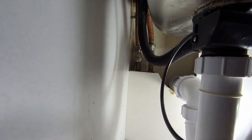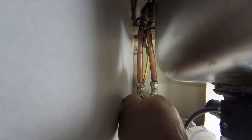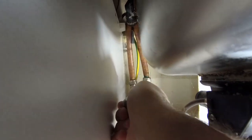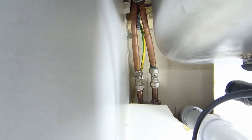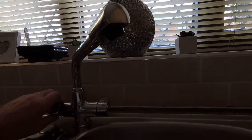What I'm going to do first of all is move this pipe out of the way to give me a little bit more access — that's basically the overflow pipe, so I must remember to put it back. Just give it a bit of a wipe up. Now I've got to isolate those two pipes there, so all we do is turn that so it's flat and turn that one again — a bit stiff, but there we go, isolated.